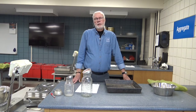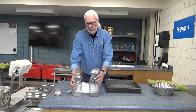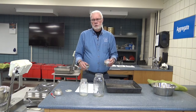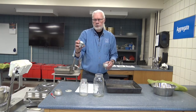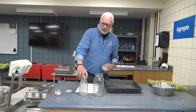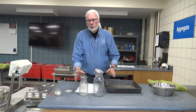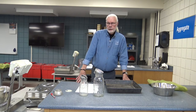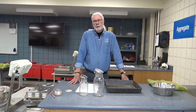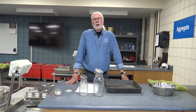Our first process is going to be calibrating a pycnometer jar. For those of you who haven't been out in the field, these are what we're referring to as pycnometer jars — a one-quart with an appropriately sized lid supplied with a gasket to seal it, and a larger lid for the two-quart jar. Historically, we've used a two-quart jar with a 2,000 gram sample of coarse aggregate and a one-quart jar for a 1,000 gram sample of concrete sand.